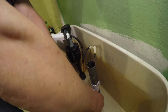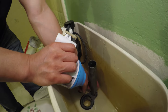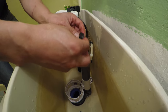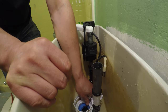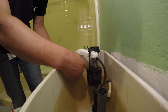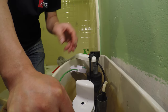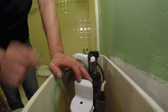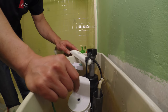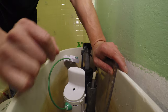There's a fin on the back — I'm not chipping that one away since the circle isn't complete there. Make sure the seal is centered and the rubber is pressed down firmly so it doesn't lift up and leak. Then press the lever, take it out, and tighten clockwise. This connects to the overflow tube so water will go into the bowl. When you flush halfway, the water level may be a bit lower, so make sure to replace the refill tube as well.